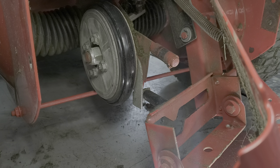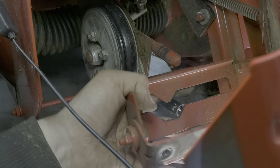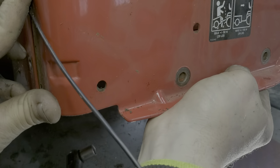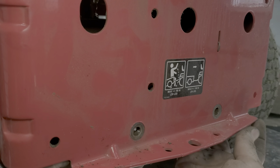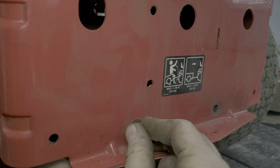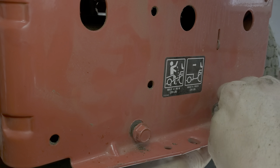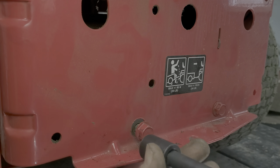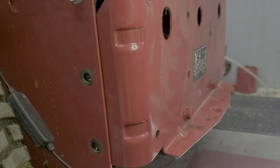Normally you won't even take this cover off. If you have taken it off, you can see it just flips up and works right onto the front — nothing really comes disconnected. It all lines back up as you put it back in. Once back together, it's just two 9/16 bolts at the bottom and the rest are half-inch around the outside. That's all there is to it — a nice easy friction disc replacement. Make sure it spins freely before you reassemble. Should take you less than half an hour. Thanks for watching — like and subscribe!